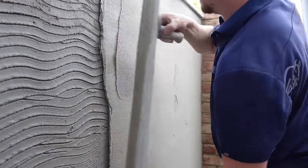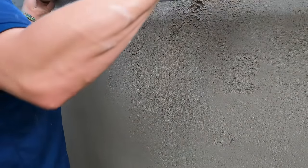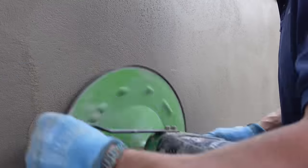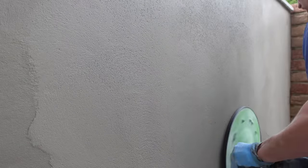Our main section is applied and it's ready to be ruled completely by my long straight edge — this is an H-Frame Rafina straight edge. It is a decent piece of kit. I'm really enjoying using the H-Frame. And then moving nicely onto the Rafina Power Flow — this is a great bit of kit because it just really flattens the wall, especially with the Weber OCR. This tool is just designed to be used with this render. It's a lovely bit of kit and you can just see it's flattening the wall amazingly.